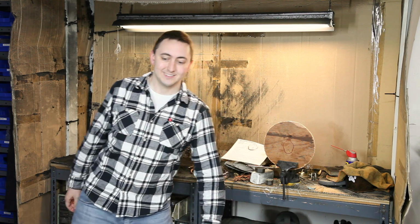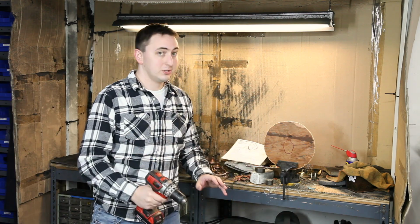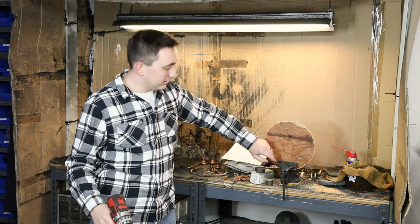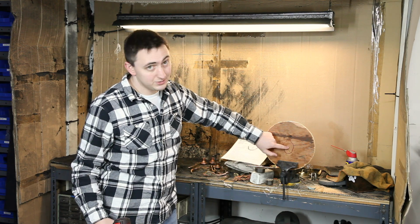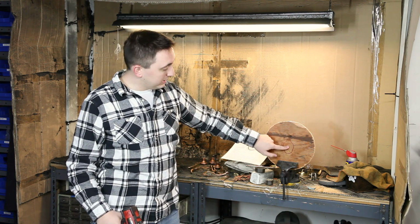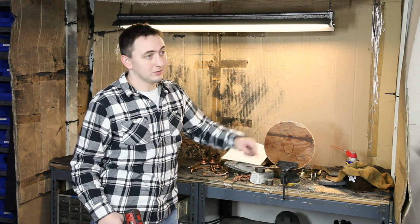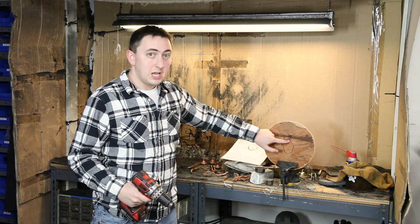So let's move on to the fun part and the drilling. The order that you drill the holes in actually does matter quite a bit for these bottom 2 circles. That's because if you drill out the bottom circle entirely, the center of the middle circle is going to get drilled out and you won't have anything to guide you. If you drill out the center circle completely, that's going to eliminate the center dot of the bottom circle. So what we recommend is drill the top hole first.